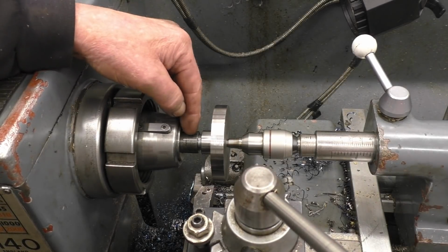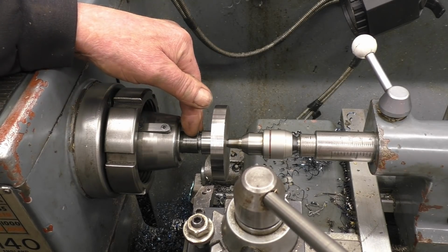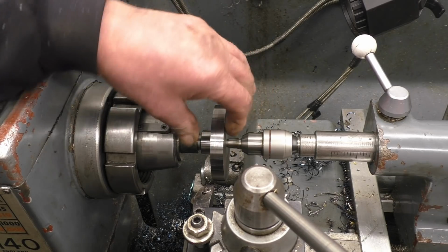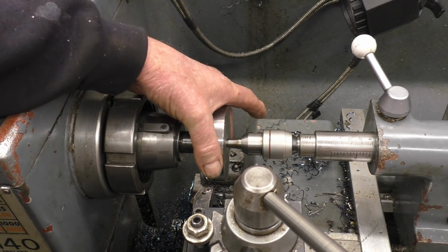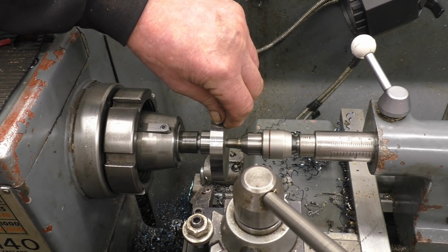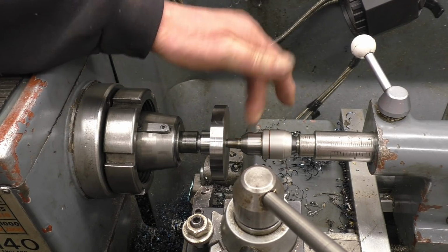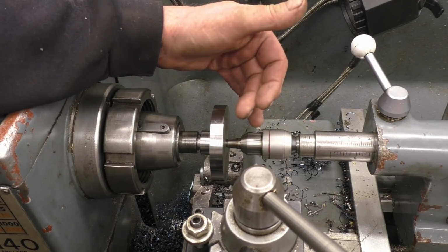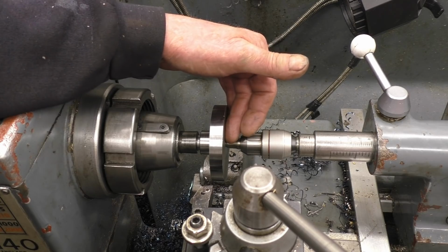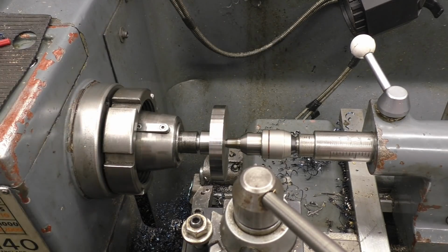I've mounted this back in. It's Morse taper centre. I've drilled it and put a centre into it as well, and I've started to clean it up. This is being turned down to 60mm diameter, and I think it goes down to 10mm thick. And there's a point to make for it. I'm going to make the point removable. I'll probably tap that 10mm so you can put a longer or a shorter point in, and then there's the locating bolts to go in there.